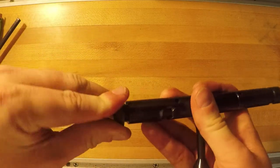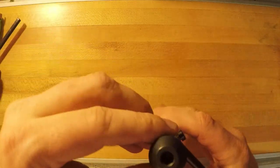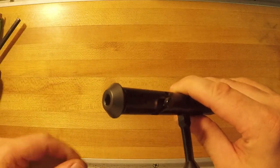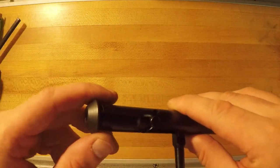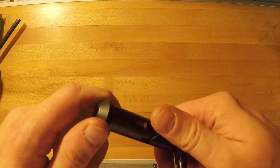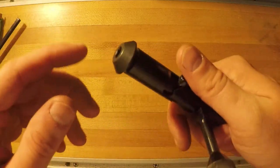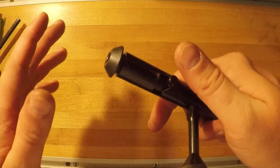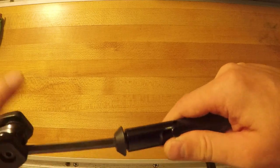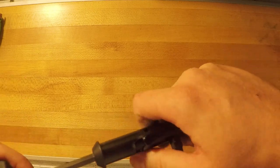Slide those in — on this bolt the washer side goes forward. Then it's just a matter of putting on your BAS. Now the new bolt assembly has a cocking indicator, and just like the 110s, it makes it a real pain to try to put your bolt back together if you don't have a tool to cock and decock the bolt using the cocking piece pin. I don't have a tool for this yet, so I'm not going to try to do it on camera.